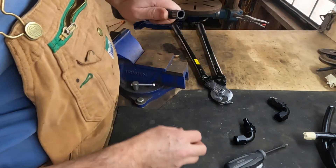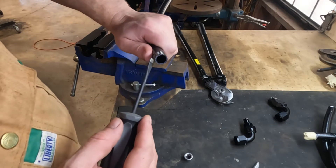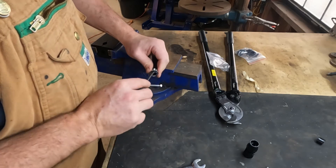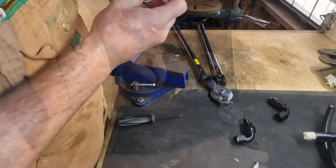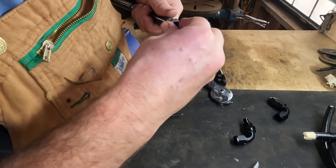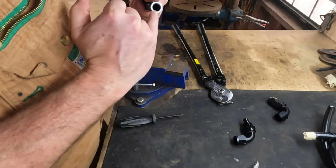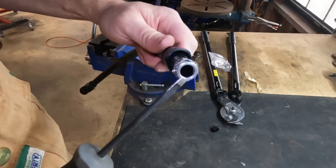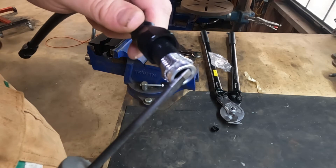With the liner exposed you can now see the stainless steel. The cut was slightly longer than our ferrule but that won't be the end of the world. Next you've got to open the stainless steel braid up — there's probably a special tool to do it, but you just need to lift it enough to fit the olive. Take the olive and carefully slide it underneath the stainless steel braid with no stainless steel strands in between, then push it all the way in until it seats. The edge of the PTFE hose should be flush with the olive.